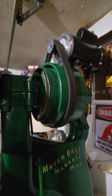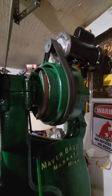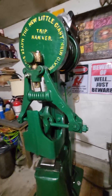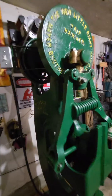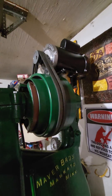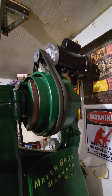I'm going to show you — I'm going to step on the foot pedal here. As I step on the foot pedal you see the clutch moves forward and it engages onto the leather, which engages the drive to move this entire assembly piece here. So I'm going to turn the power on — you see the motor is spinning, it is not engaged to the leather clutch.